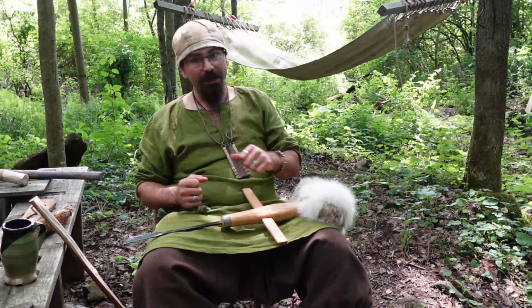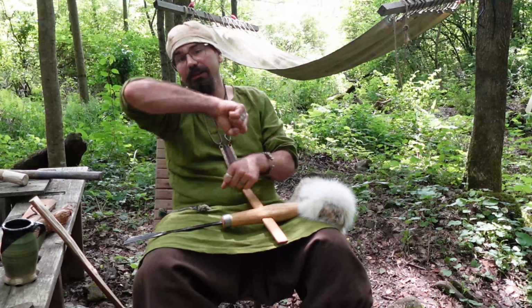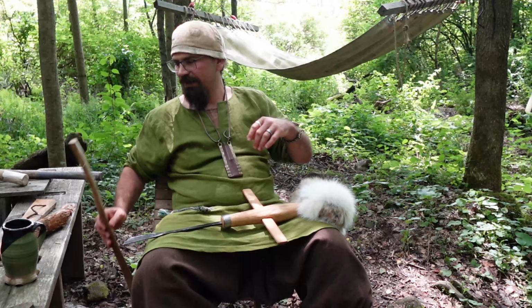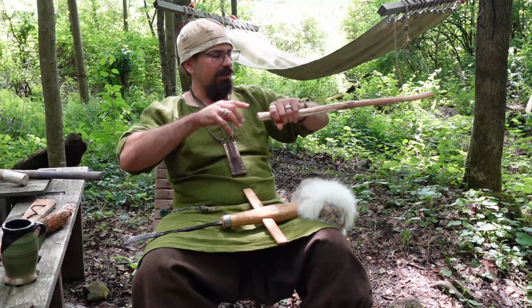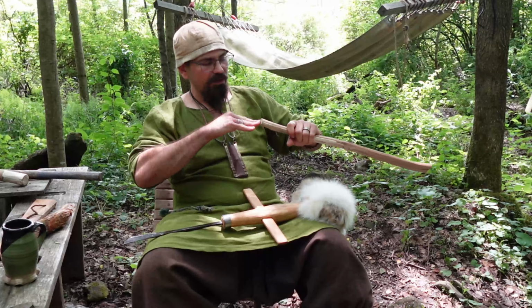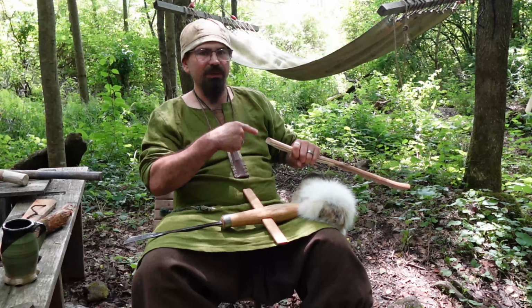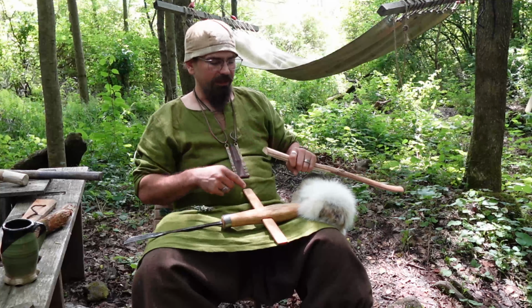With a Scotch-eyed auger, it's righty-tighty, lefty-loosey, right? You've got to go right. I don't know how that might affect anyone who prefers to go left, because for a million years it's been righty-tighty, lefty-loosey. But that's one difference. The time's not too different. If you're boring a hole into the end of something, and you're not going all the way through, you're going to have to stop and clear your project more, because you're going to get buildup in there. When going through at the angle I was at, I hit a point where it kind of filled up and then started coming out.